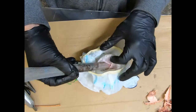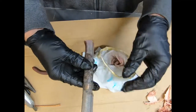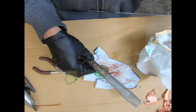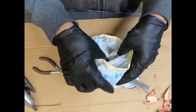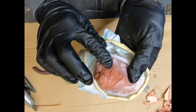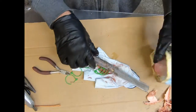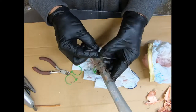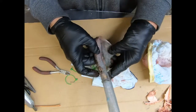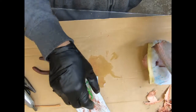That looks like the stainless steel is damaged a little bit — it's very thin stainless and not a very high grade at all. That's not the end of the world. Look at that — that is proof that we are indeed digesting the copper filings, so we do not need to cast those into anode bars. I wouldn't worry about this screen being eaten up; this is definitely the side facing the cathode and the erosion is very minimal.